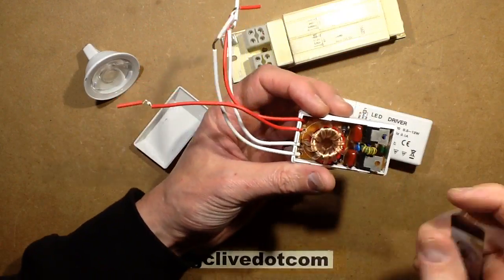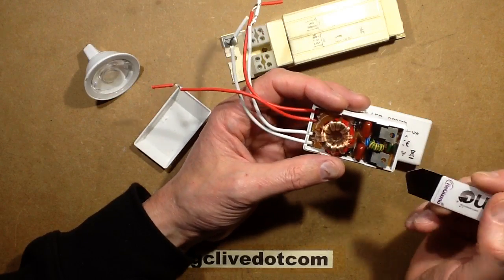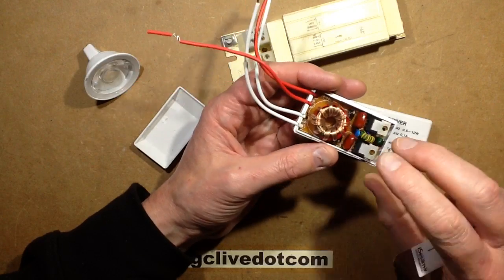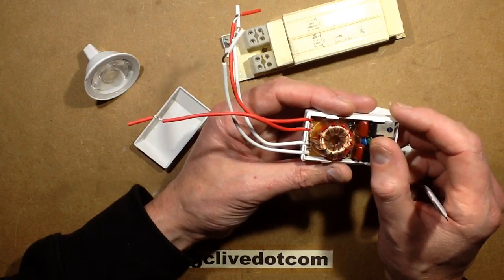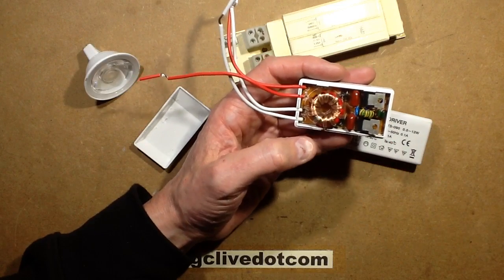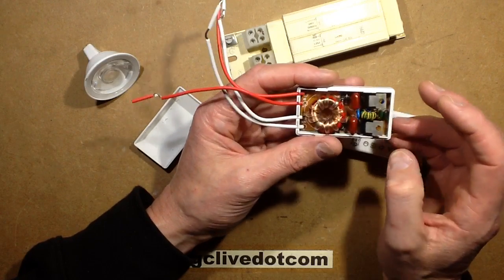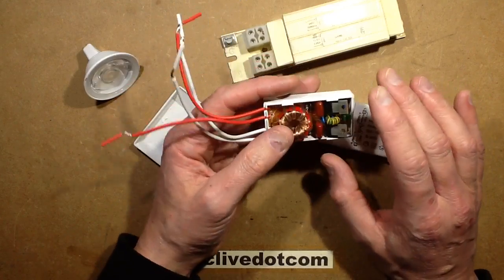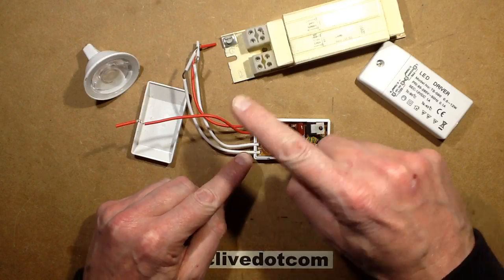What's happening inside this is that it is running a traditional halogen lamp, but the mains comes in, it goes through these rectifying diodes — this bridge rectifier — and then there's this push-pull arrangement with a feedback transformer, very similar to what you find in compact fluorescent lamps. It drives a step-down transformer at high frequency — it's basically a little switch mode power supply. One main difference from a normal switch mode supply is you don't see a smoothing capacitor in here.